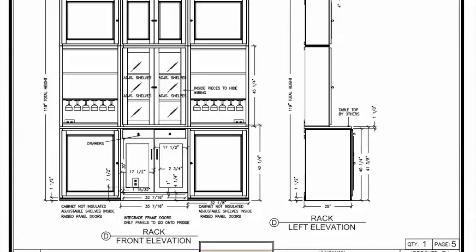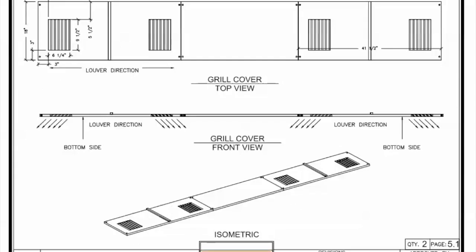The upper section is 13 and a half inches deep. The center is an enclosed cabinet with adjustable wood shelves. LED lighting surrounds the front door area on both sides and above this cabinet. To the left and right are wood shelves. The bottom shelves include a glass rack underneath. At the top of the bar we included four closed wood cabinets for more storage. The crown molding is four inches in height. We also included indirect LED lighting above the cabinets behind the molding. All knobs and handles were supplied by Wine Cellar Specialists and are from our vineyard collection. The grill cover mounted on the ceiling of the wine cellar covers the RM3600 twin evaporator system, made for easy access for maintenance.